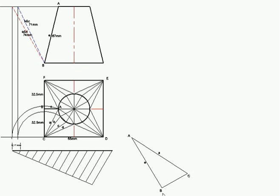So the next triangle, we did this little one, so we're going to do this one. We've got A to C, we've already got. I now need to find line B. So the true length of B, we've worked it out here as 71.